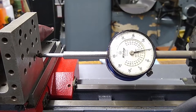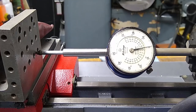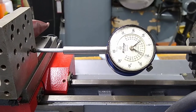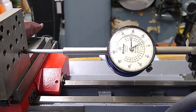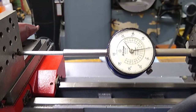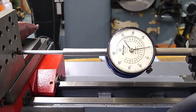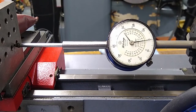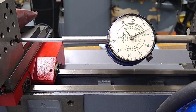Now here's where we're going to check our lash. We're going to go back: G01 Z0 F5, go back to zero feed rate of 5, Alt S — one through ten. Okay, it looks like we've got in Z about eight tenths. So I'm going to take this back, take the backlash out of it and go back forward. Okay, we're back at zero.